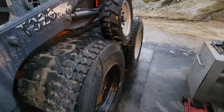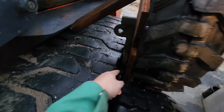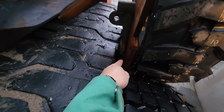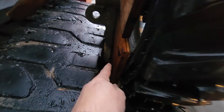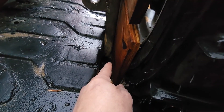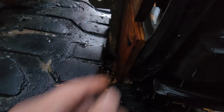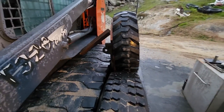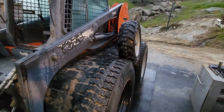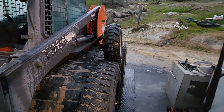What that means is the reason this looks like it sticks out is because this retread here is shifted inwards about a half inch. But what I may do is improve this angle — I will remove that one of these days when I get some time, open up that joint down there, cut it on the inside, spread it open about three to five degrees. That's probably what it needs.